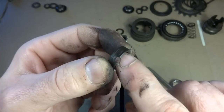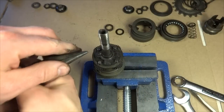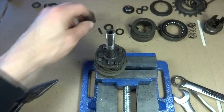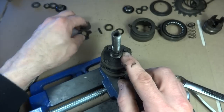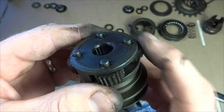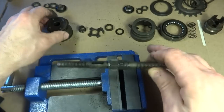There's a washer there I wasn't expecting. Then there's a little part with notches that face down. There's also a key — I'll push it out using needle-nose pliers. See that little hole? That's where the indicator pin screws in. Now I can lift off the little clutch. There's a small part underneath that goes down there. Pull this off — it's got all the little planetary gears in there, and the pawls down below. There's the axle. Now we have it mostly disassembled, other than the sub-assemblies.